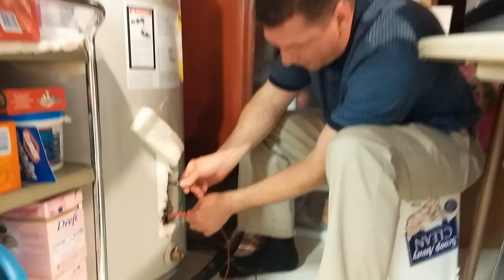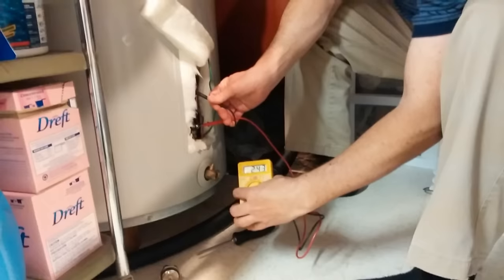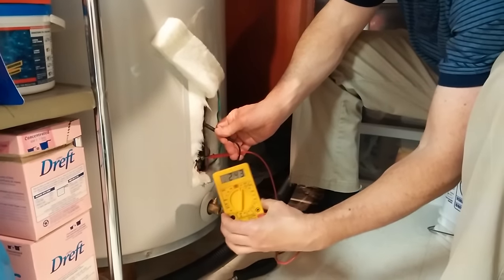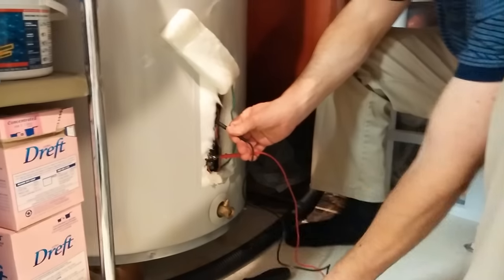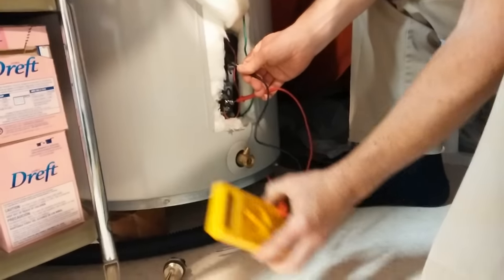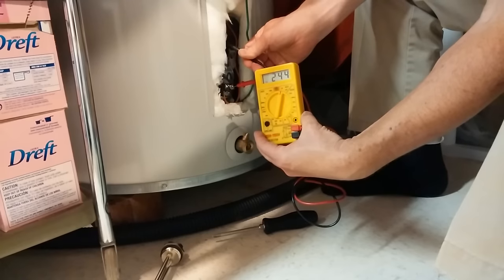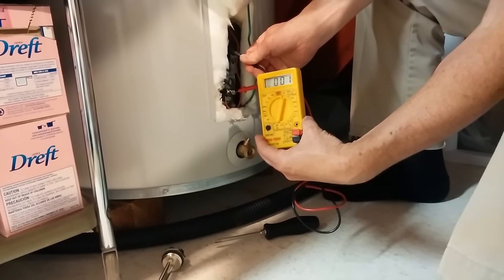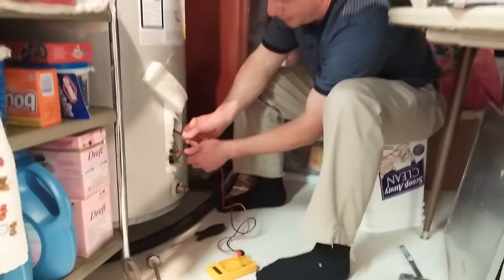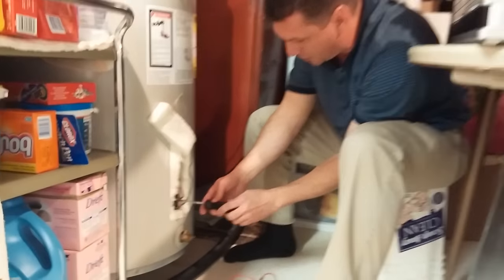First thing you want to do is, while you have your water heater on, double check that you actually show current. You see 243 volts here on your probe. So set your voltmeter and keep checking until you see voltage. Go ahead and shut the thing off. And then you'll see when she shuts it off that the voltage goes to zero. That's the best way to know that you've actually shut it off, because if you get no reading on it, maybe you're just testing it incorrectly. So have it on to do your initial test, then make sure it goes off.